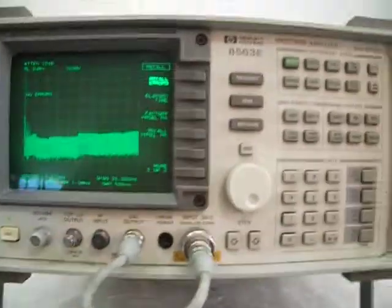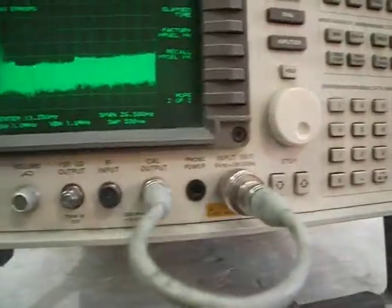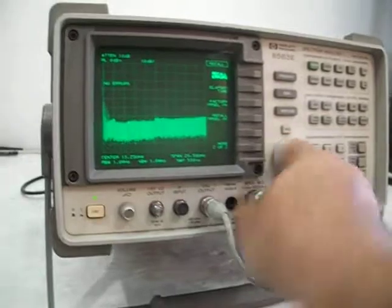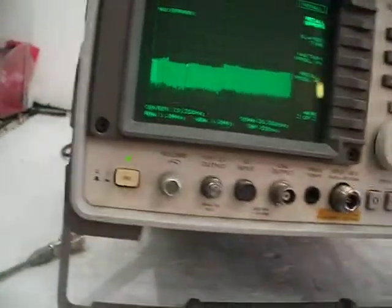We just calibrated it in our laboratory. It's not an official certificate calibration, but it is very accurate. So we need to check the frequency response here. Let's see the frequency response of this unit across the range. We'll use two signal generators because I have one running up to 20 gigahertz and this one covers 18 to 26 gigahertz. Let's start with up to 20 gigahertz.